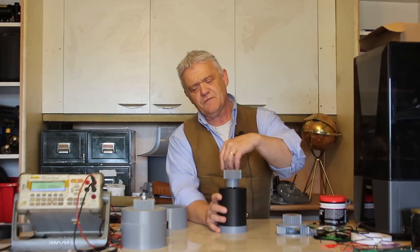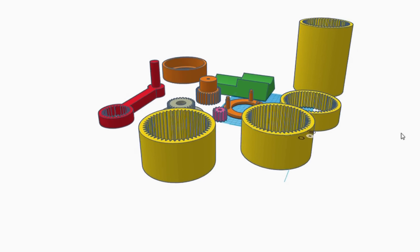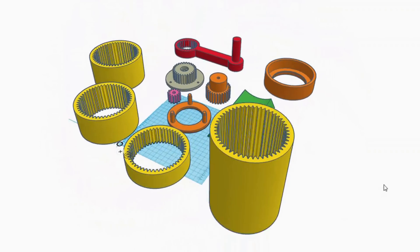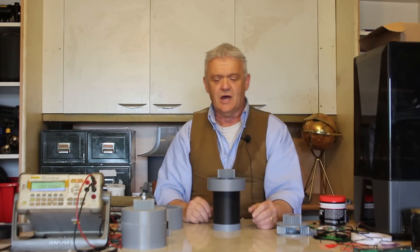Now of course it's been spinning freely so all we got out of it was a couple of watts, because the torque requirement is so low. What we need to do now is gear it up. I've designed this in Tinkercad — those files are freely available in the description link — and we're going to use a stacking planetary gear system. This is the connection ring; it fits on the generator and then our gears can fit on that.